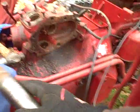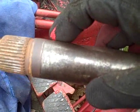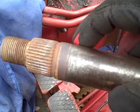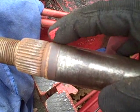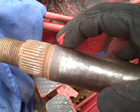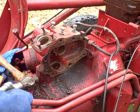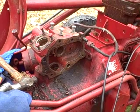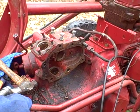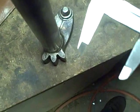Could be this area on the shaft that's all oxidized - a light rust coating. Maybe once I got past there it would be okay. I want to see if I can clean this up. I can take some measurements and see whether or not this area is significantly larger in diameter. If it is, then just cleaning up this end might do the trick. If not, then I'm going to do what the service manual warns you may have to do: ream the new bushings to accept the shaft. Unfortunately I don't have a reamer large enough - I may have to invest in one.